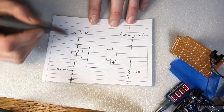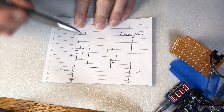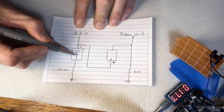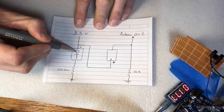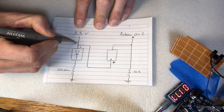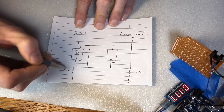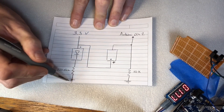Here's our schematic — it's very simple. This 3.3 volts comes off the Arduino board and goes to the sensor, coming in to the top of this diode-looking symbol here. Basically this is an LED — it comes into the top. And as you know if you've played with electronics, you have to have a current-limiting resistor on the back of an LED or you'll burn it up. So this resistor here is 100 ohm.